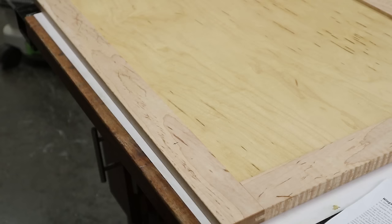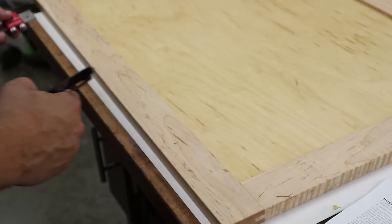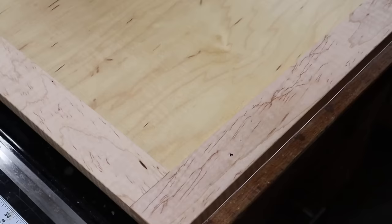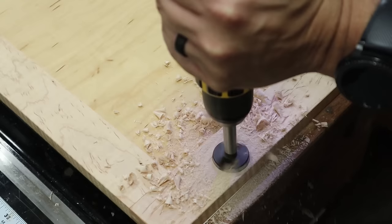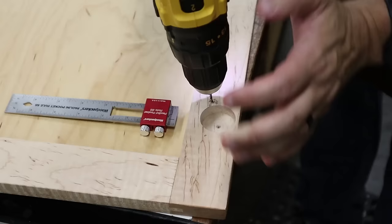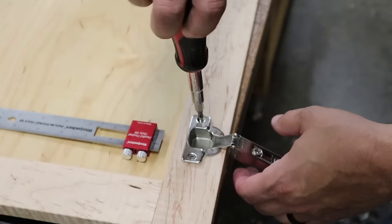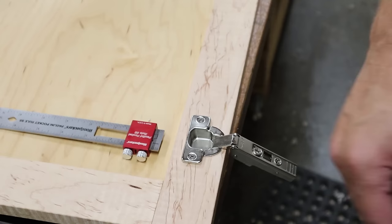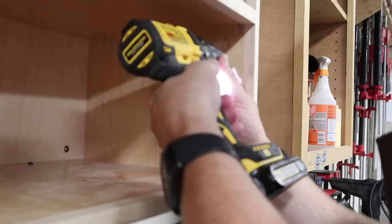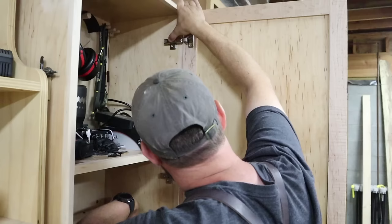Now we're in the home stretch — the final step is to add the mounting hardware. I'm going to use Euro-style cup hinges. First I mark out the location of the cups, then I cut the recesses with a Forstner bit that is 35 millimeters in diameter, which is pretty standard for cup hinges. Since I did this by hand, I stopped to check the depth to make sure I was sneaking up on the half-inch deep recess needed for these hinges. Just follow the directions that come with your hinges for proper placement and depth. I then mark out the corresponding locations on the cabinet side and pre-drill my holes. Once I get one hinge screw in, I can mark out and pre-drill the locations of the other holes — this really helps line everything up.